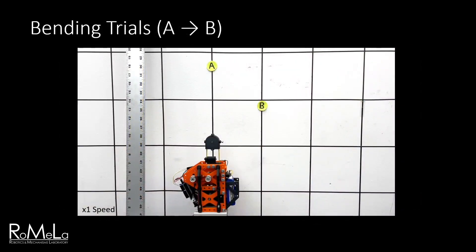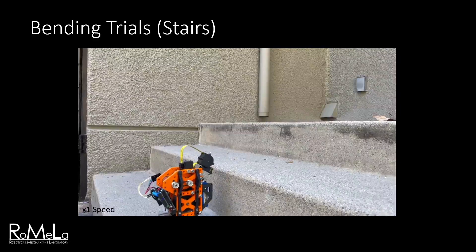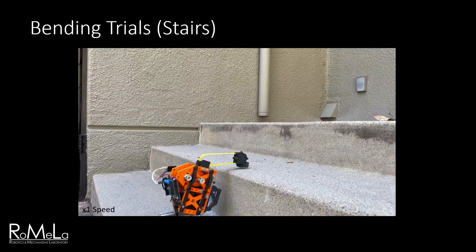In this bending demonstration, the limb is commanded to extend to point A, then bend to point B. After extending, the brake function is activated, entering bending mode. When the moment applied to both ends of the tape reaches a critical value, a coherent fold is induced in the center of the limb, allowing it to bend to point B. This bending action showcases the limb's two controllable degrees of freedom using only a single main motor for the spool. Here, the bending feature is used on a staircase to place a microspine anchor on the top surface of a step. The tape's spring properties help passively maintain the microspine's orientation so they can properly engage with the surface, even after a failed anchoring attempt. The microspines pulling in the main body shows that they have engaged successfully.